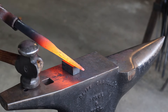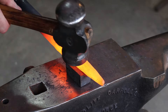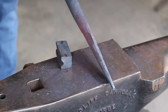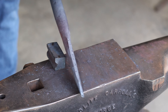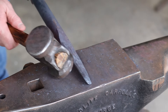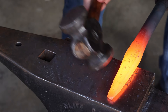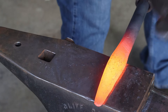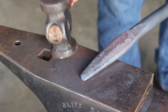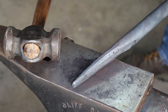I'll do this one strike at a time because I'm already bouncing around. I've got a facet developed on the back of the drift at this point. I'm going to move on because I've developed a banana shape the opposite direction, and I'm going to forge in more of that bevel and hopefully bring that back to straight by doing that. I think that is going to do it for the bulk of the forging of the drift itself. It's certainly not perfect and it's going to take a lot of refinement on the grinder, but in the grand scheme of things I think this is working out pretty well.